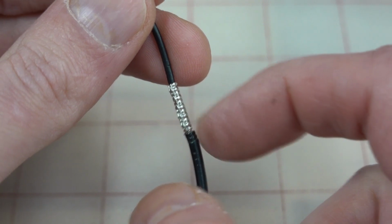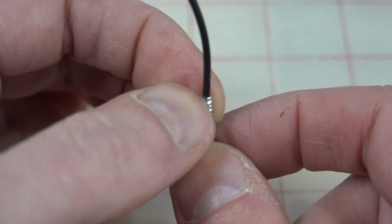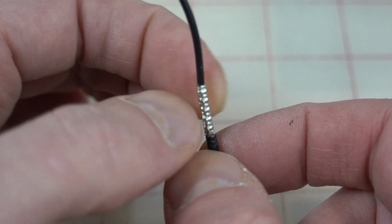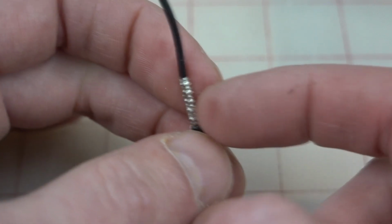You don't have a huge amount of wire hanging out. You don't have the insulation into it, maybe a little on top, but that's okay. If the insulation goes in like an 1/8 inch on this, doesn't hurt it at all. As long as it crimps down all the way in the middle, that's totally cool with this type of connector.